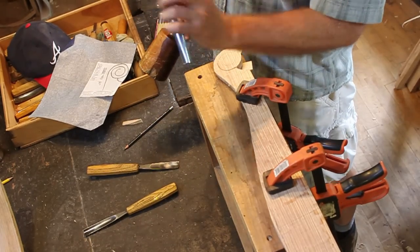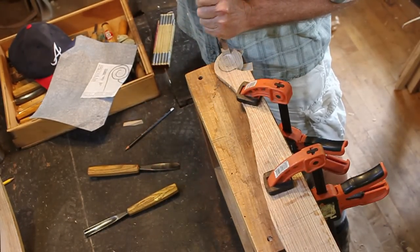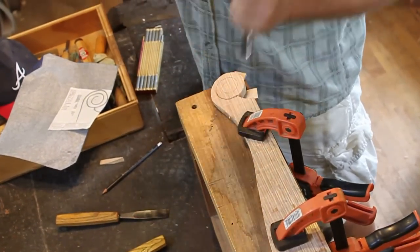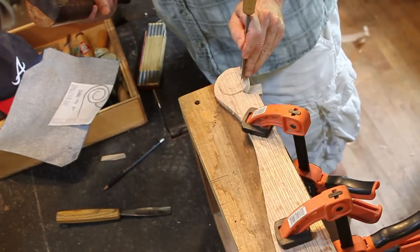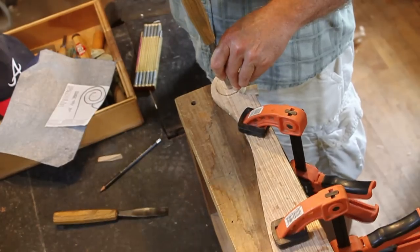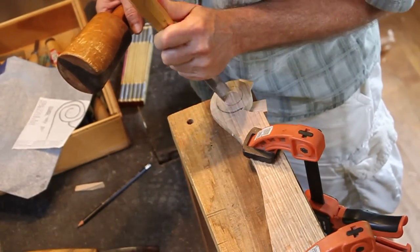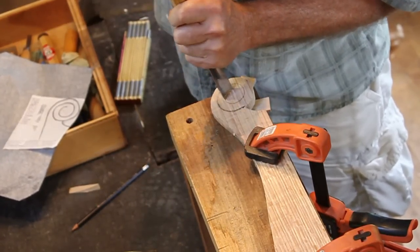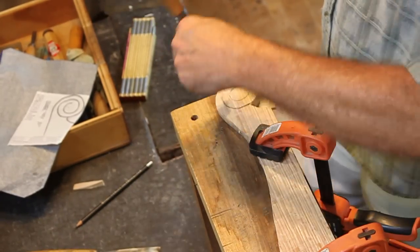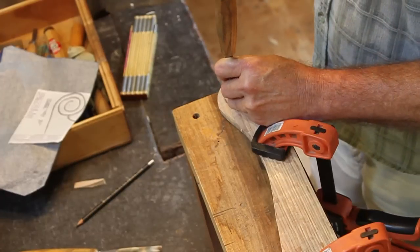So for those of you that have some of these chisels, that's a number 5 sweep, probably about 3/4 inch wide. Right there's a 7 sweep. So now I've got to connect an 8, which ends it with that 7, and I sort of jump all the way over to the end and position this one on there about right like that, I guess. Jump back to the 7 and see if it works, and it doesn't connect just perfect, so I'll kind of cheat it a little bit with the corner.